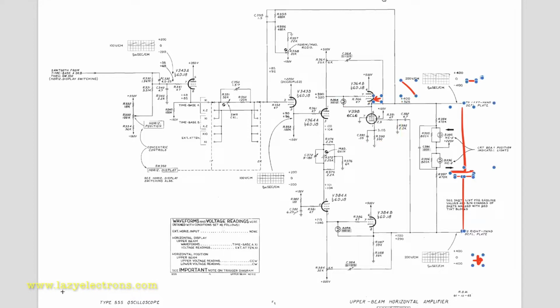What it does is, this high frequency capacitance driver tube is actually driven by the positive side of the sweep, and that is directly sitting in the cathode of the final output triode. And on high frequency ramps, it can provide an additional shunting path to discharge the capacitor on the negative going side, and that's why it's called a high frequency capacitance driver.